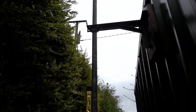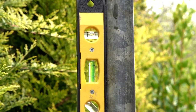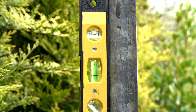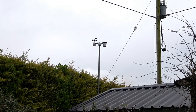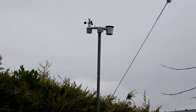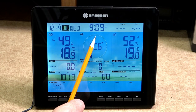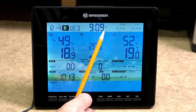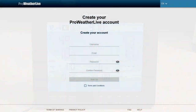At this height the balance indicator cannot be seen. In my case a spirit level can be used on the side of the pole going up to the array. If the pole is vertical on all planes indicated by the spirit level, the balance indicator on the top of the sensor array should be level. After the sensor unit has been successfully fitted, come back to the console and check that there is communication still between the console and the sensor array.